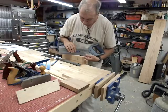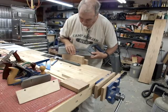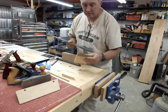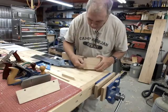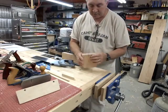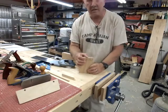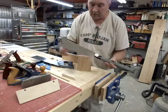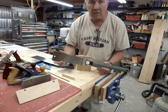And this saw, properly set and properly filed, I'll show you what it can do in a piece of 1-inch oak. I've made some test cuts. I have a line that's 3/4 of an inch deep. We'll count the strokes and then we'll look at the thickness of the cuts. I've already done some cuts with both saws, and I'm going to tell you right now, this saw will outcut what I know and have already claimed to be the best $30 or less saw you can buy.